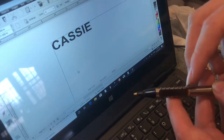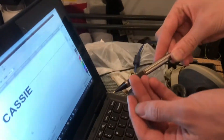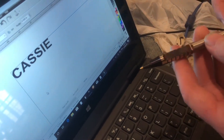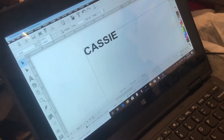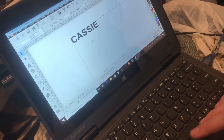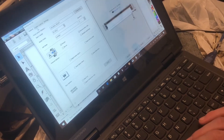I'm going to be using a US Cutter vinyl cutter to make a mask for this pen, and then I'll be doing some chemical etching to engrave a name right on this flat spot. I just put the text in with the text tool, but you can of course import an image from Inkscape or other vector software. And so I'm ready to cut.